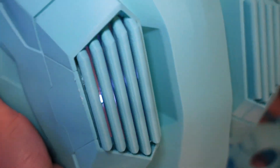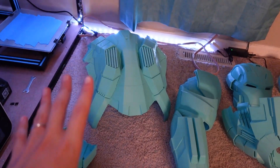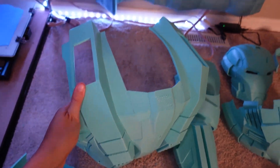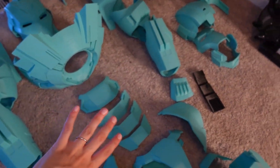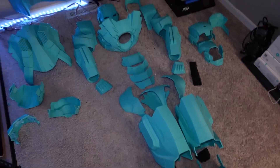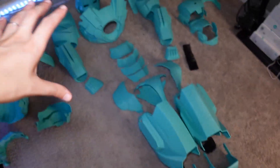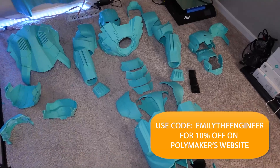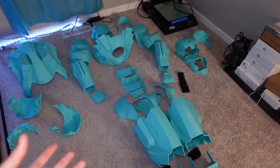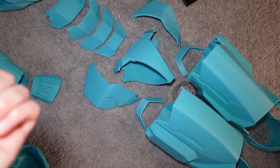So now we finally have the helmet after three iterations. I left holes in the vents — the goal is to have smoke coming out of the back, whether it be compressed air, CO2, or something like that. I also left holes on top of the shoulders to have shoulder missiles popping out. We're continuing with the spring idea for the abs. The sides of the abs are going to be made out of TPU and I'm halfway done printing that. Everything that needs to be printed out of PLA — which by the way is all Polymaker's PolyMax PLA — is done, with the exception of the hands, which I'm hoping to have resin printed.